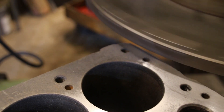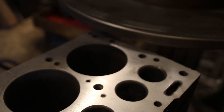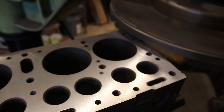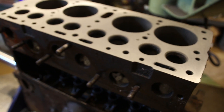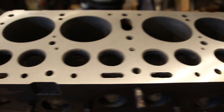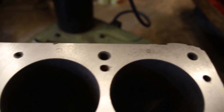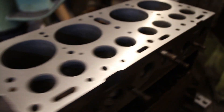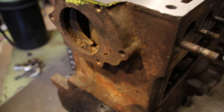Looks and sounds good. There goes another two thou and it looks like we're just stretching out to the end. If we get it through the middle we'll be in good shape. And if this one cleans it up, that'll be a six thousandths clean up. Okay Bertram, there it is — perfectly flat. It took six thou to clean everything up and we reached all the way over to the other side. This is going to go up on the SIP machine now and we're going to set up and see what we're going to need to bore this guy to. So it's coming along.